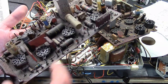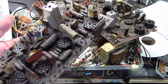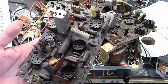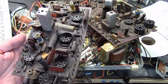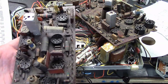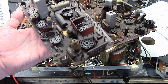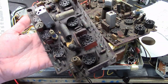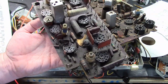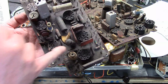Generally speaking, when I have gone to the trouble to test these resistors, I'd say about half of them are typically out of spec. Would that really make the set not work? No. I have had sets where a resistor was completely open, which drastically affected their performance, but the set still turned on and produced a raster. But again, once you have the board out and you're working on it, if you want to go through and check every single resistor before replacing it, knock yourself out. I just don't think it's worth the effort. So that covers the carbon comps — the ones you typically find on the board.